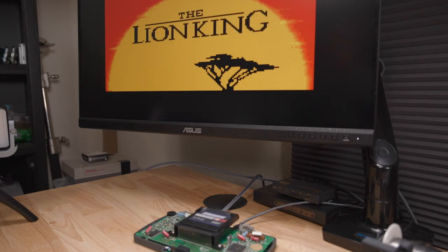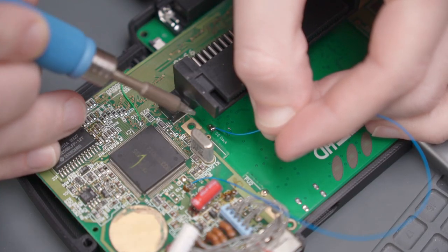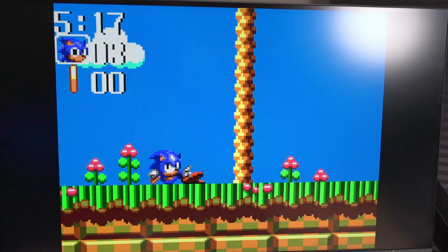I tested the console, and after a few minutes I could still see the color bars. So I tried a 3-inch wire and a 4-inch wire, all the way up to the recommended maximum 8 inches. And while the color artifacts never completely disappeared, the flickering was greatly reduced and the time between the flickers was longer.